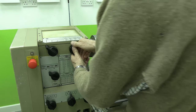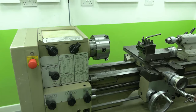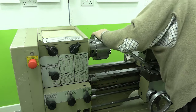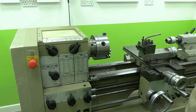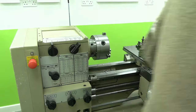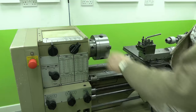That even works on this — I never use these top two speeds because they're scary. That's 1700 RPM and this is 2500 RPM. Don't stand in line with the chuck. It's actually rated to 4900 RPM, so we're fine. I mainly use 540 or 370, sometimes 800 RPM.